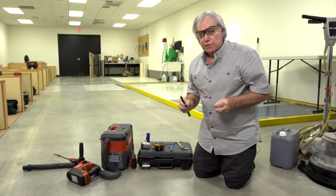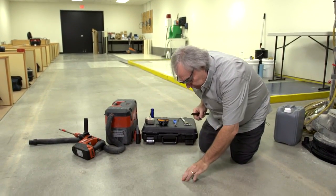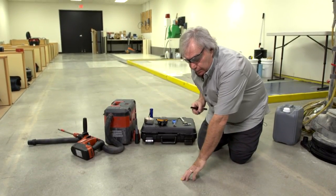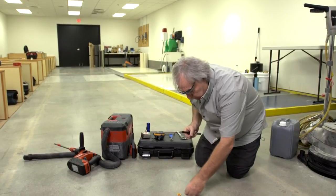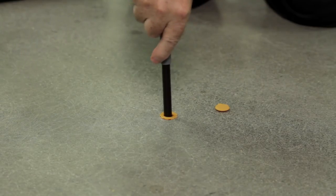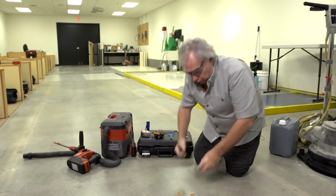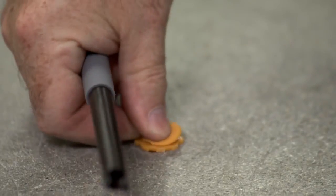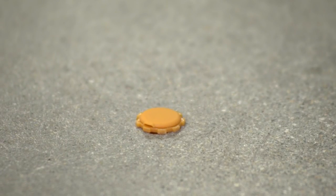Now that the sleeve is set, we have two options. We can cap the sleeve and leave this to acclimate to the time period required by the ASTM standard. Or we can insert the probe onto the setting tool, push it to refusal at the very bottom, give it a back-off turn and remove the setting tool, cap the surface, and now wait the required time of the ASTM standard.